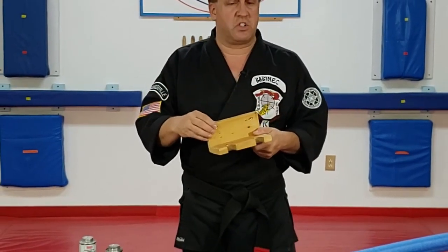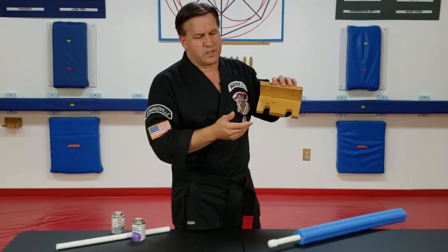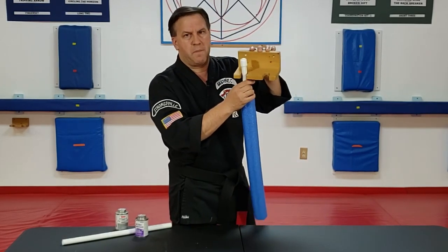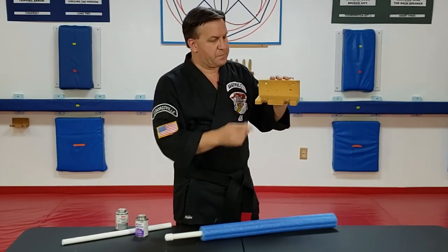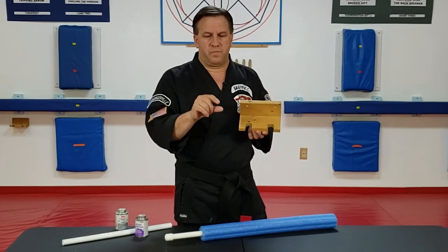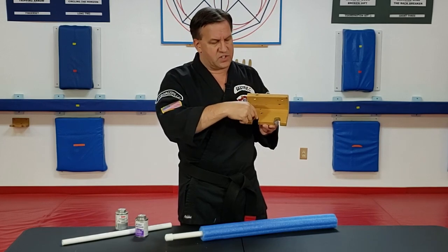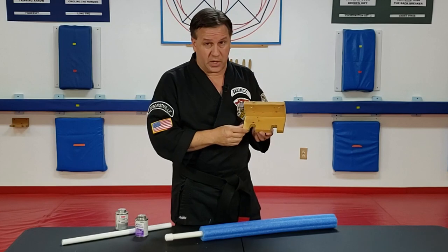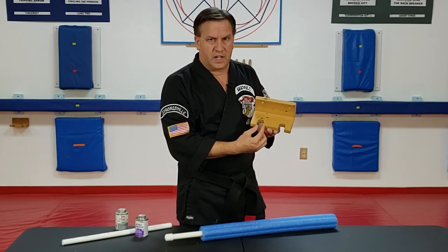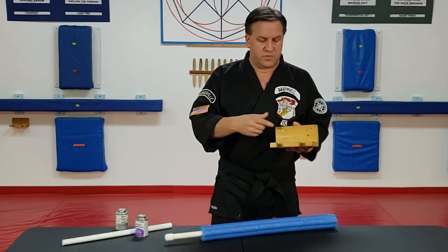You can use drywall anchors or just screw it in with drywall screws. The front is again six and three-quarters this way — it's not quite four inches because it's a one-by-four. This is a one-inch opening so the half-inch pipe fits in fine and will just hang right off the opening. This is one and a quarter inches deep. If you're building this, get a one-inch spade bit and drill the hole first, then use a hacksaw or reciprocating saw and just go up — perfect hole every time. This is one inch from each side, then about an inch and a quarter in. Then you just screw it right into the wall.